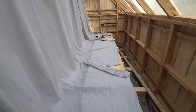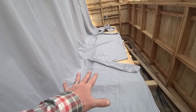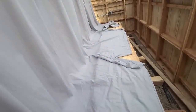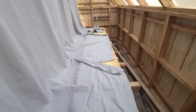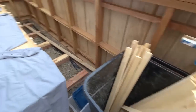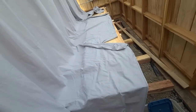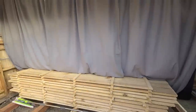All right, guys, after a little time, all I really need in the kiln here is something to put on top of the stack so that I don't make contact with the material here and the wood. I'd like to have a few tin panels or something like that that have a sticker mounted on the bottom of them. Then I could rest that on top of the stack and put the sheets just like this. As long as they're not blocking the airflow back there, I would just drape them over like that, and the front would look like that.